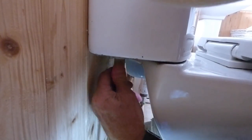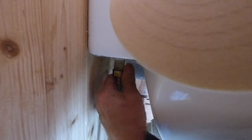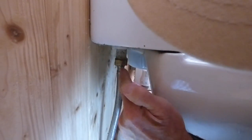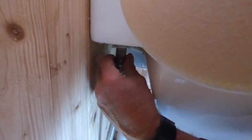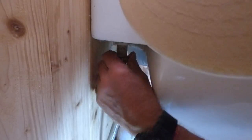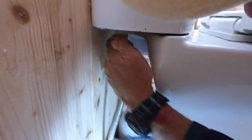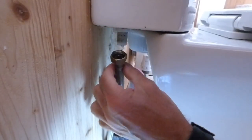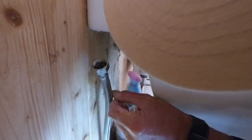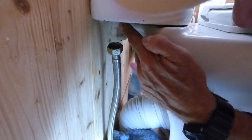You should be able to do it by hand. I've got a flex here as you can see. You can see the water coming out of there — that's the little bit that was in the valve. Don't worry about it, it will ease off — that's why we've got a towel on the floor, just to catch any little bit left. Pull it right undone and just pull it away like so. You can see a little sealing washer inside there, that's used to seal the joint.